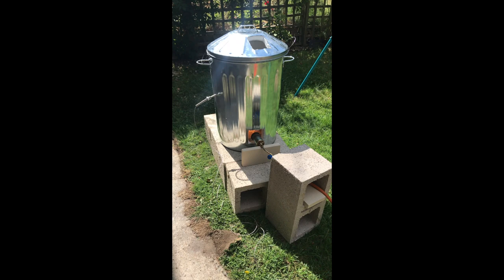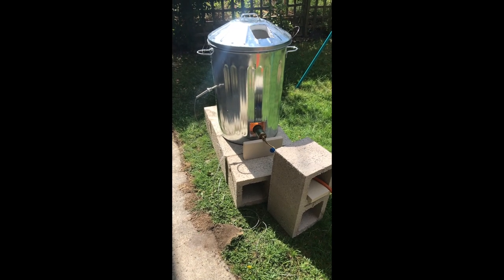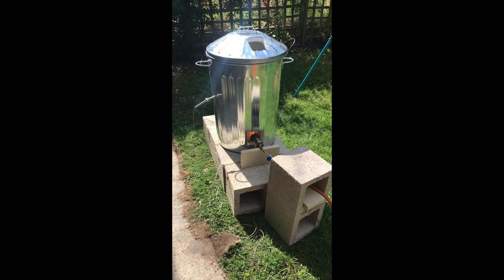With this setup what I found was that I just couldn't get the kiln up to temperature. My plan was to get it up to 1010 degrees centigrade which is 1850 degrees Fahrenheit, but actually it reached 715 degrees centigrade and then it sort of hung there and started to drop off slowly. I realised something wasn't quite right and decided the best thing to do was to switch it off, do a bit of research, and find out what adjustments I needed to make in order to get the kiln to reach temperature.